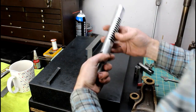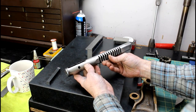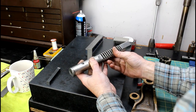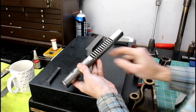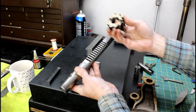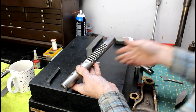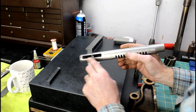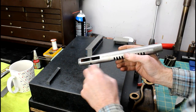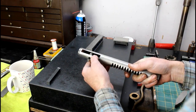Now, looking at this shaft, I would say most of the work that was done on this thing was done on a horizontal mill. Just a guess. Like this, we've got a radius here, a flat that leads into a radius, and I would say that was done with a large shell mill running across. Then they probably did the gear teeth, and this is definitely a horizontal mill, big radiused scallop, I guess, in there.